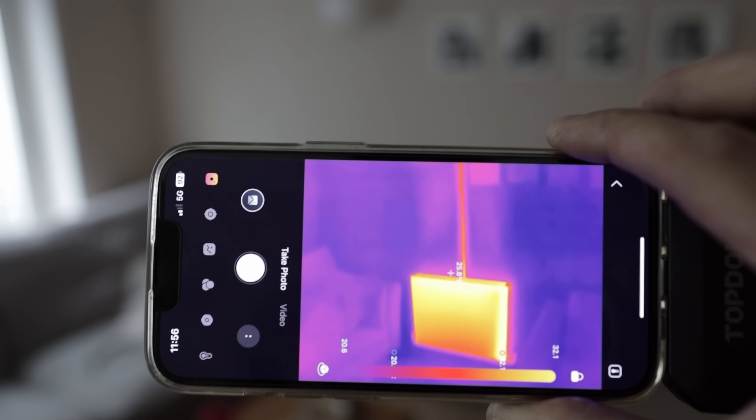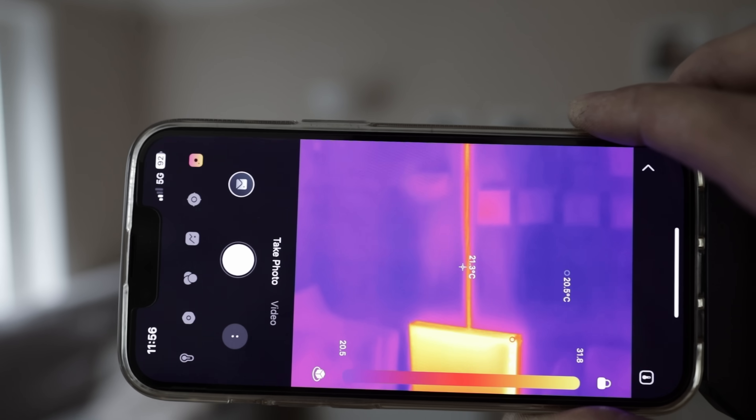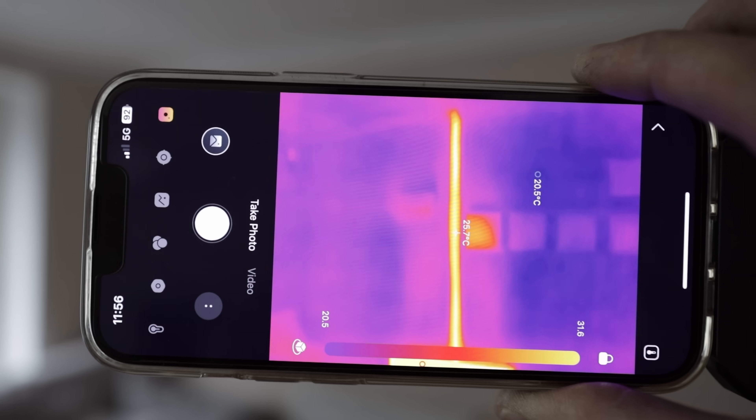You're going to ask: how do I know where the pipes run or the length of the pipes? You don't — so you have to make assumptions. You won't always get it right, but by measuring how far the boiler is from the radiators and estimating pipe routes, you can turn the boiler on during the survey, use a thermal camera, and see where the pipes are. It's better to have an informed guess than not to calculate at all.